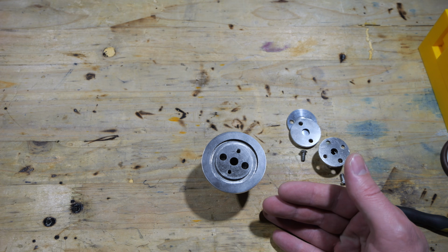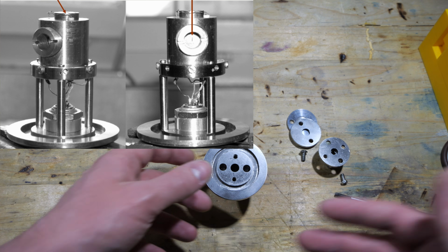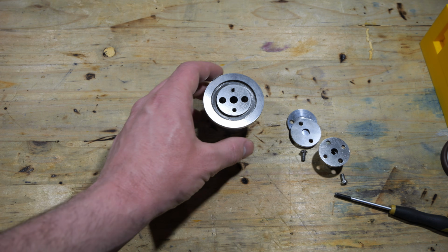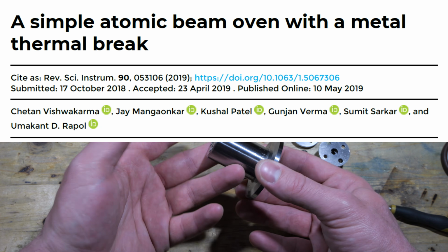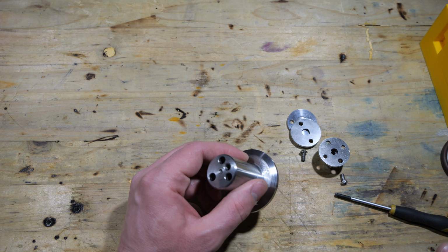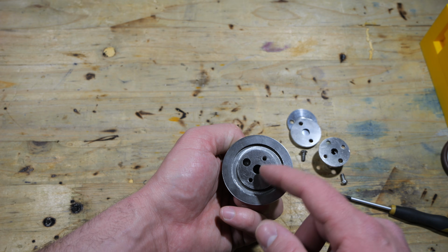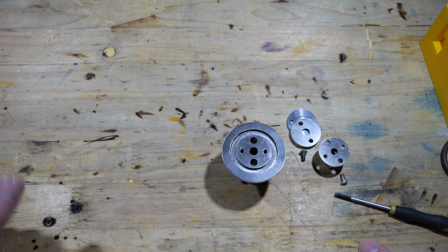There are different ways to design an atomic beam furnace. The ones I found were pretty hard to machine, or pretty complex, because all of their parts, the heating wire and everything, were inside the high vacuum. To make it simpler, I searched for simpler designs, and I found a paper where they described basically this design right here. I designed it in Fusion, but I ripped the idea from this paper. I will link it in the description down below. You heat the chamber from the outside, and the only things exposed to the high vacuum are your element and the inside of this furnace. That makes the design way easier, and that's the way I chose.